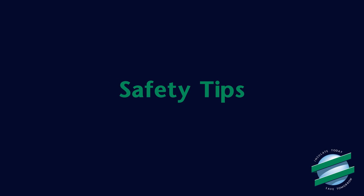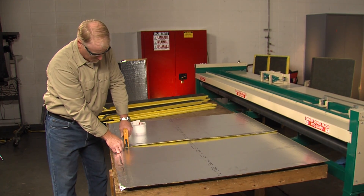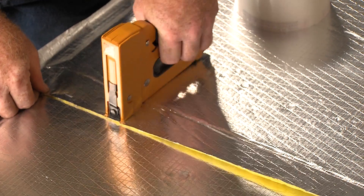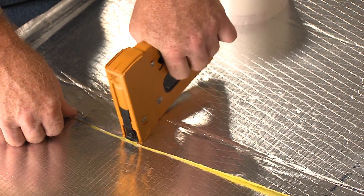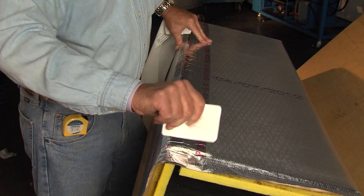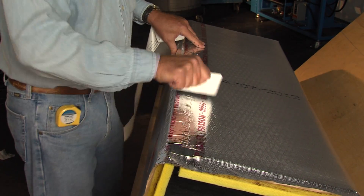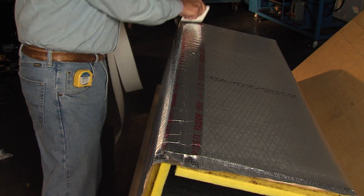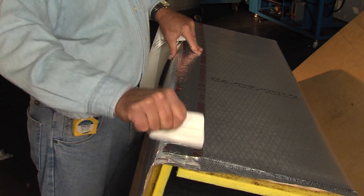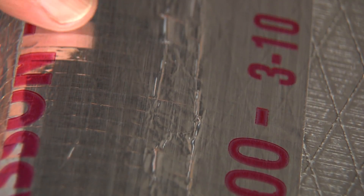There are a few other tips that you need to be aware of, and we will remind you again during the demonstrations. When using the staple gun, make sure it is perpendicular to the surface of the duct as you staple, so that you don't get a leg of the staple coming back up through the facing. For that very reason, do not use your hand to rub down the tape on the closure system. As you will see, the tape goes over the staples — use a squeegee at all times to get a good seal and to protect your hands from getting cut from random staple legs.